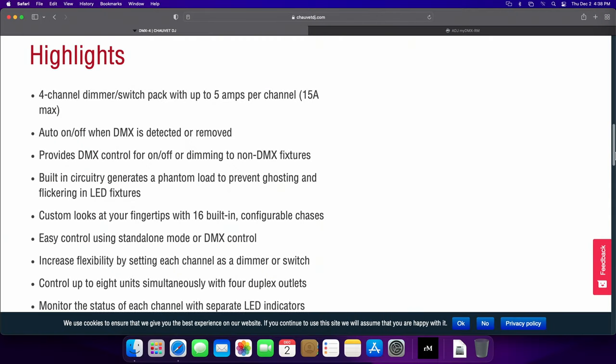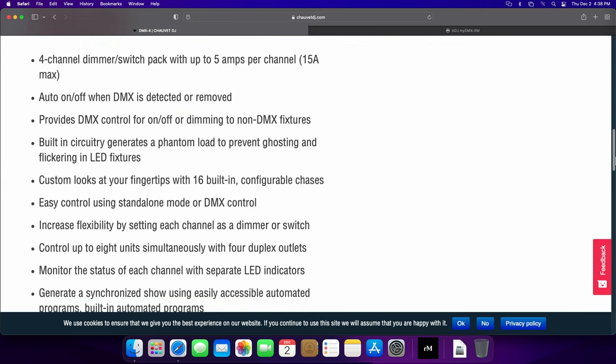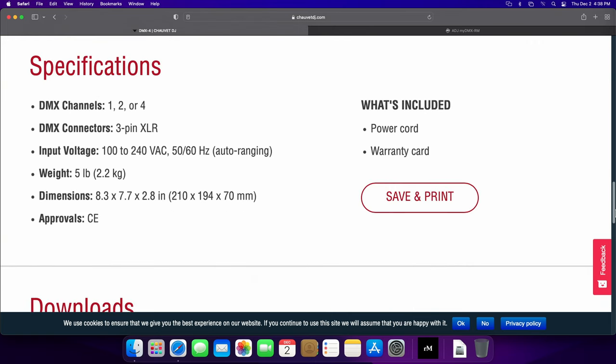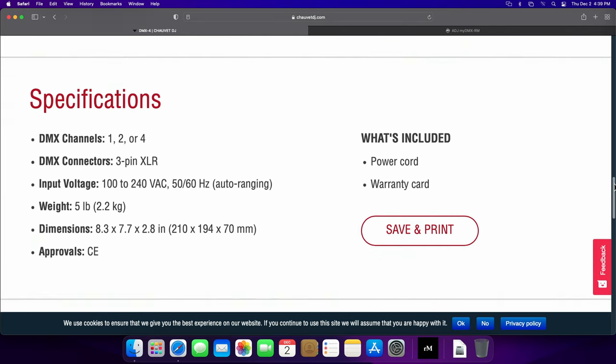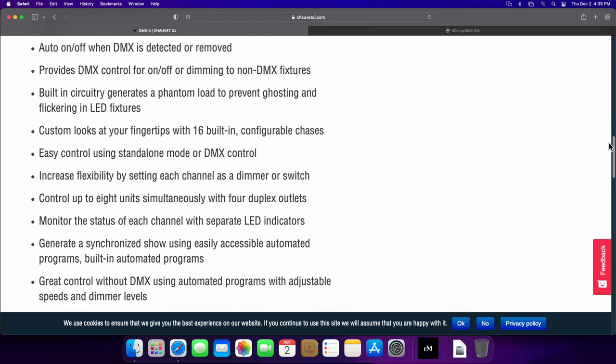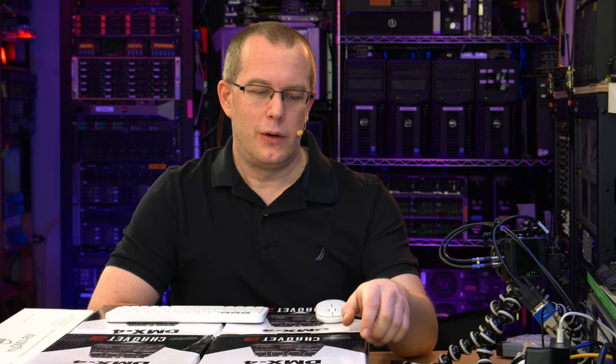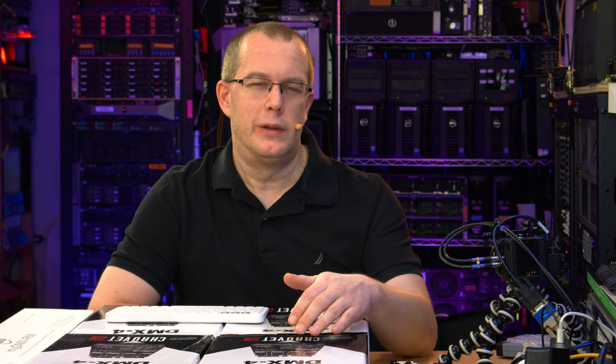Here are the product highlights. I'm not going to be using any of the built-in sequencing features. The specifications show it is multi-voltage. One weird thing is that on the electrical specs, it says each channel is up to 5 amps, whereas on the actual boxes they're fused for 7 amps — not a huge difference, just a weird inconsistency. Obviously the whole unit is only rated for 15 amps, and it comes with a 14 gauge cord, so you really wouldn't put more than 15 amps through this thing. Each channel is individually fused at 7 amps.